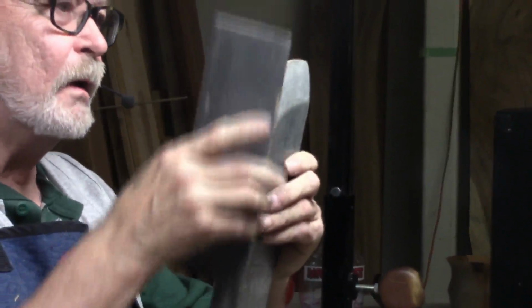It makes it better. So it doesn't take very long. You work one side. You work the other long side. I do 5 cuts with a long point, so I'll hone like that. 2 cuts with a short point, so I'll hone like that, and I'm done.